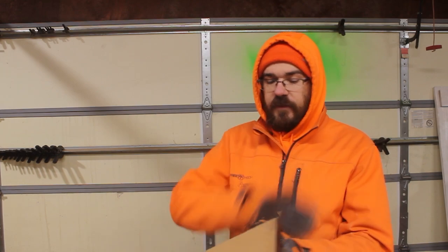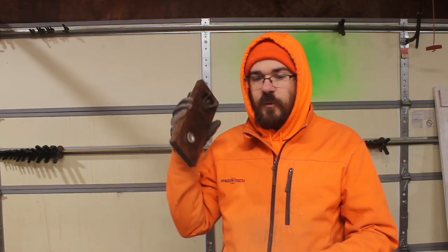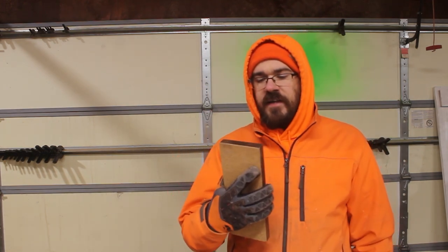just made it stupid to apply the cork because the finish that I used was Howard's orange oil finish with beeswax and stuff, and the wax in it, I think, made the adhesive not want to stick, so I had to sand the back of it real good after the finish dried a bit so that I could get all that off so I could actually get the cork to stick. But it's stuck on there now, so pro tip, don't finish the backside. I normally don't, but I did this time because I are dumb.